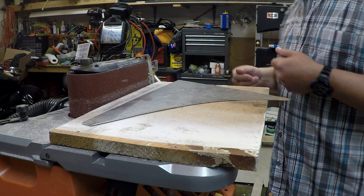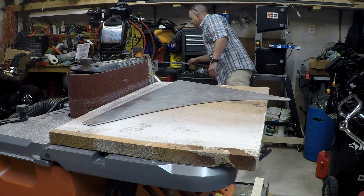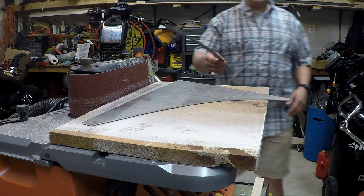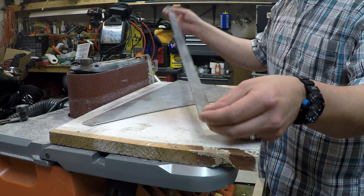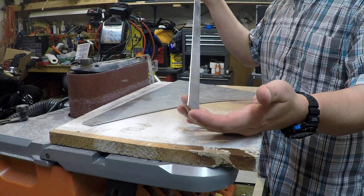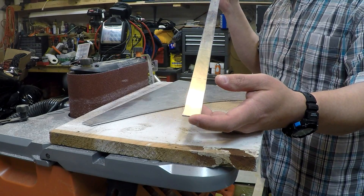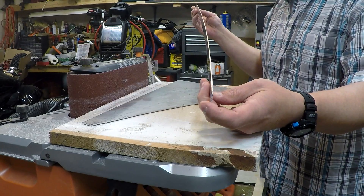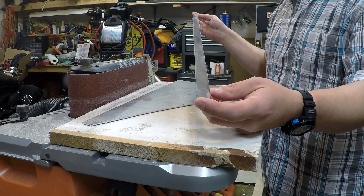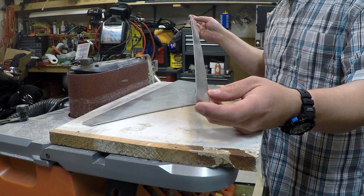For the larger pieces, there are numerous pieces on this build that for 63-thousandths are quite long. This cabin side doubler is about two and a half feet long, and there are fuselage doublers and other things that are even longer. A couple of channels you have to make are nearly four feet long in this thickness, and it's quite hard to work with and get a good smooth sanded finish.